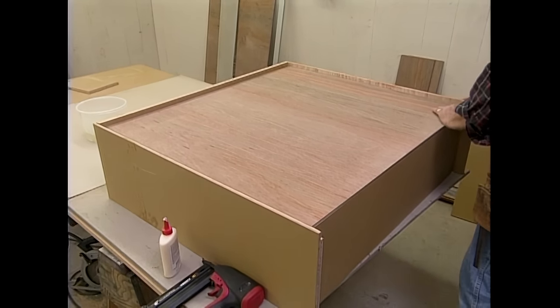The masonite that I'm using on the top is a good choice because if it gets dinged or ruined, it can easily be replaced. The 2x4s were half-lapped creating a base, then I have 3/4-inch plywood, and then I used an inexpensive material to cap it — 1/4-inch masonite. If it gets dinged or ruined, remove it and put a new piece down.